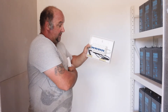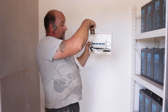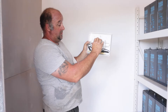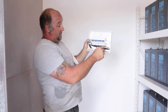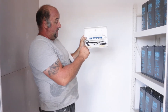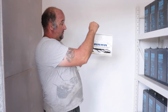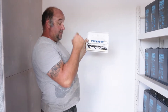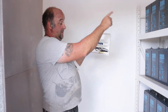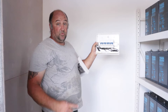This is our solar combiner box. Basically all the solar panel cables come through the top and go into these breakers. We've got four strings of panels and it's just a breaker on each one so we can isolate the panels from the system. Then we bring the main positive cable from here out the top into the MPPT, and the negative does the same into the MPPT controller, which we'll put on next.